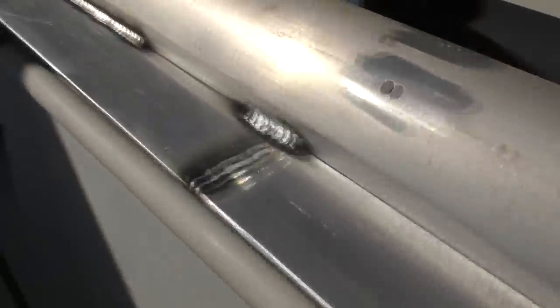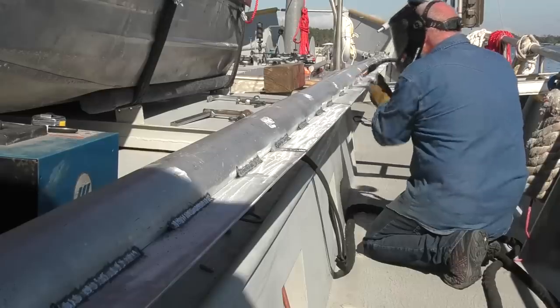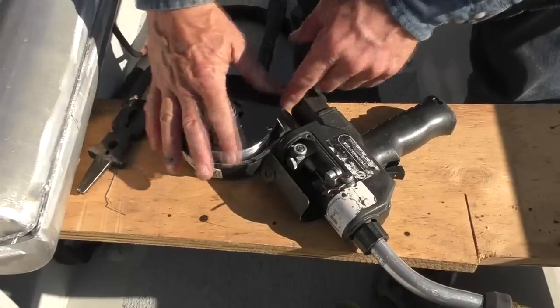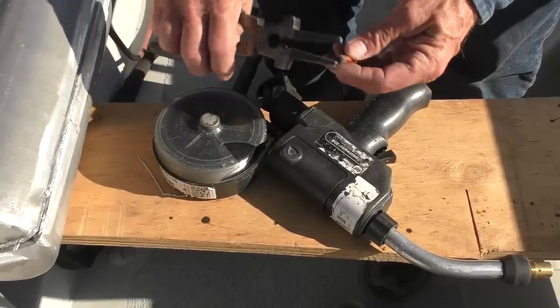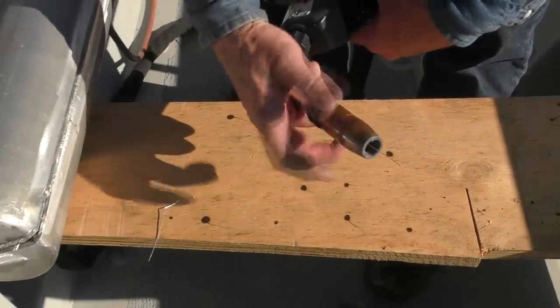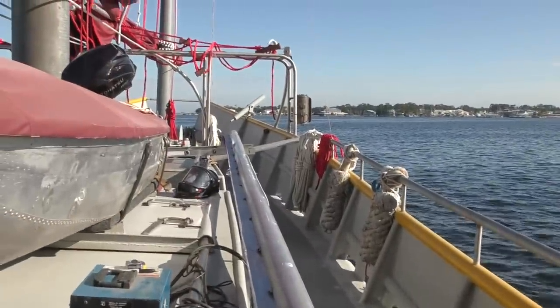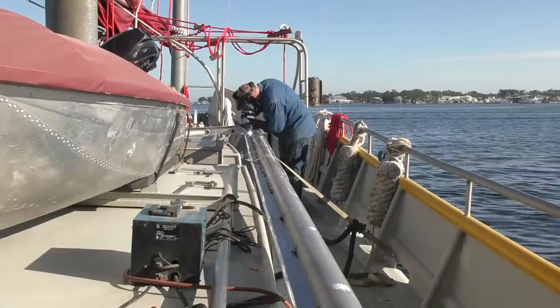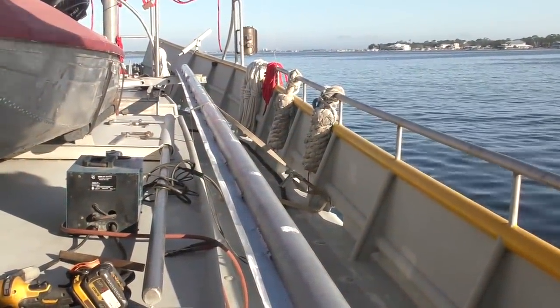I've got some long welds in now, about every two to three feet. I released the tension again - it's still doing okay, so I'm going to come back and put another set of welds in between these. I've flipped it over and it does have a slight upward bow, so I've supported it out at both ends - a board down here, a ladder down there. I'll put a strap in the middle to pull it down a little. I'll let it cool down, release it, see what it does. I let the strap off and it didn't move hardly at all, so we're doing the right thing apparently. Now I'll roll it over and do some on the other side.